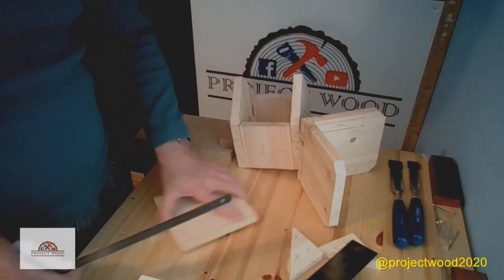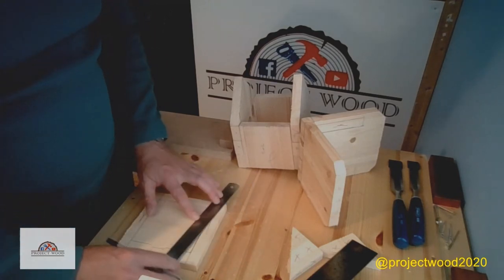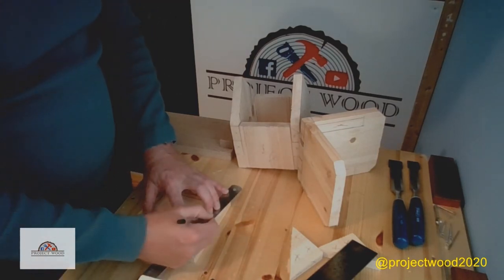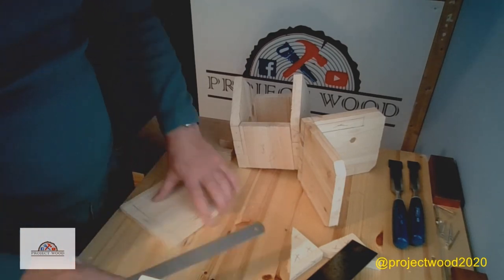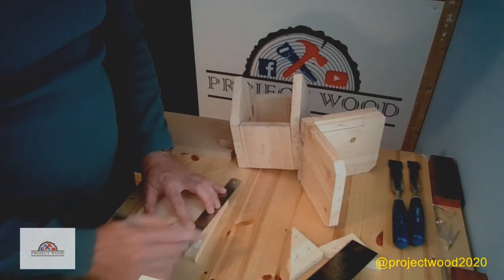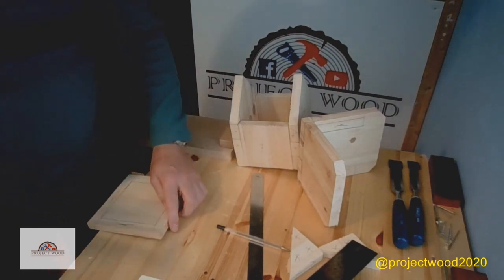There's also a case to be made that when your screws are placed centrally and evenly, it does actually help in stopping warping and distortions when the whole thing is put together, especially on outdoor projects like this. It's very important that it's structurally very sound. So there's our four X's again, and we'll drill our pilot holes for those.